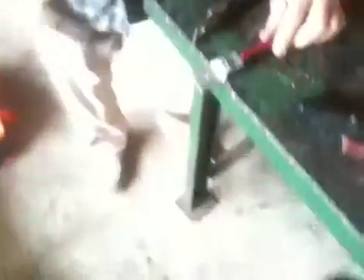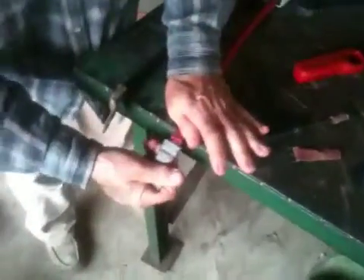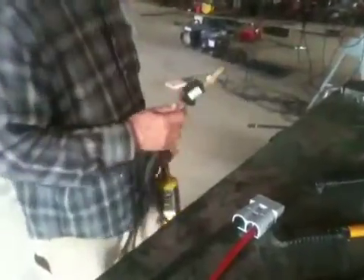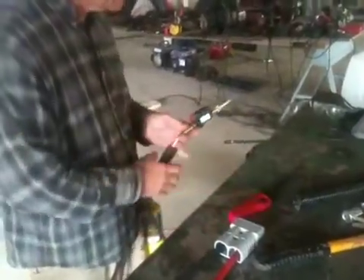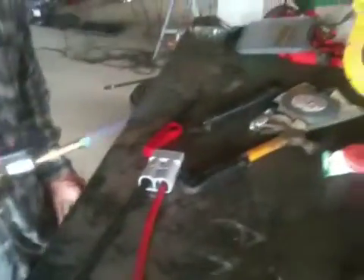This is silver solder. There's the electrical grade stuff, and there's some of the other with rosin in it. And that's MAP gas — not propane. MAP gas gets hotter, though it doesn't need to be very hot for this small surface.